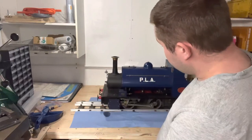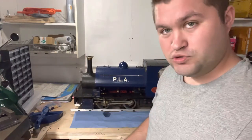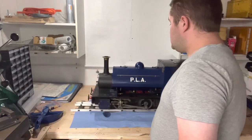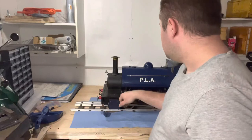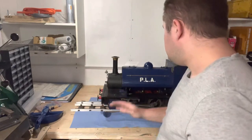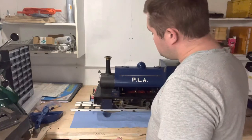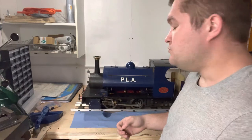The drain cock on one side tried to work, but this side not so much. They are in fact dislodged from the linkage, which will be the first point of order. Second point is the lubricator — mostly doesn't work either. Not a lot goes down; occasionally a little water comes back. She obviously gets enough because she keeps going, but she's not happy.